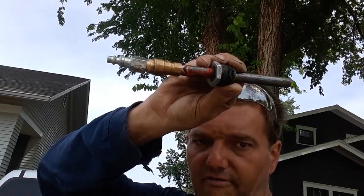After the three-quarter inch plug, you have another quarter-inch tube going to a quarter-inch air ball valve. I put that on there so I could control with one valve how much water I'm letting out and with the other valve how much air I'm letting out.